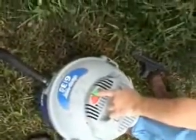First thing I want to do is clean debris. We're using a shop vac — preferably a wet-dry. We're going to start right inside there, cleaning any debris out of the pan, the condensate pan. And also right here, the insulation — you see the insulation gets some debris. It's a good idea to clean.